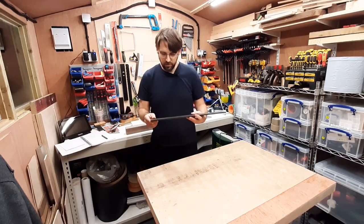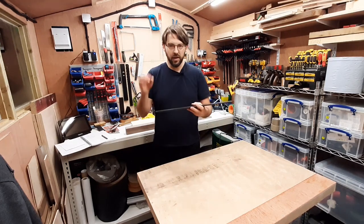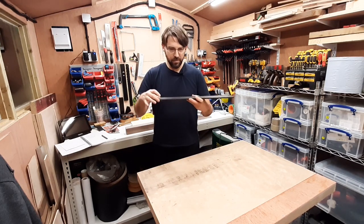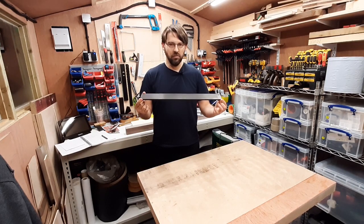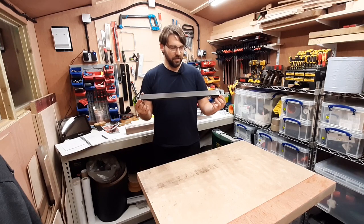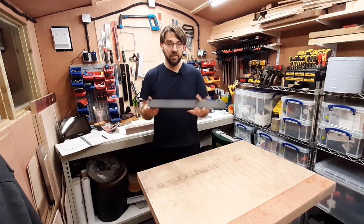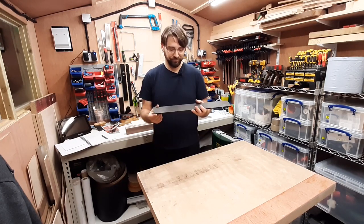The next thing I need to do is I'm going to use the toothpick method of making sure the fretboard doesn't slide around. On my previous guitar, I didn't worry about locating pins for the boards I used for the neck or for the fretboard, and they did move. I'm not going to make that mistake again.